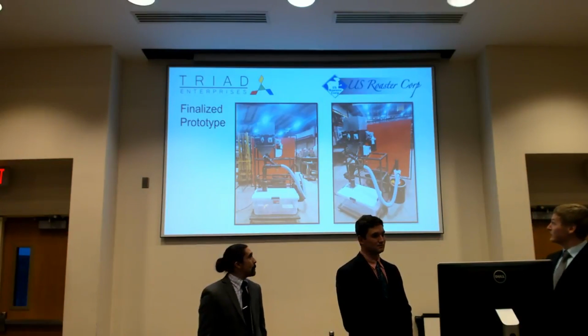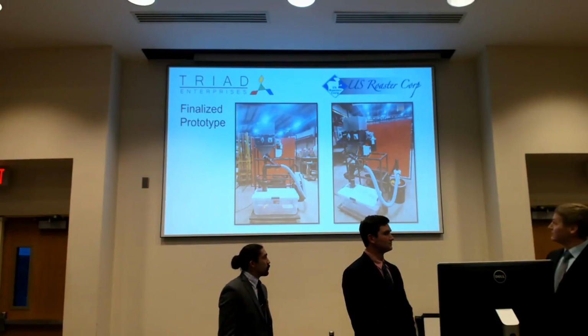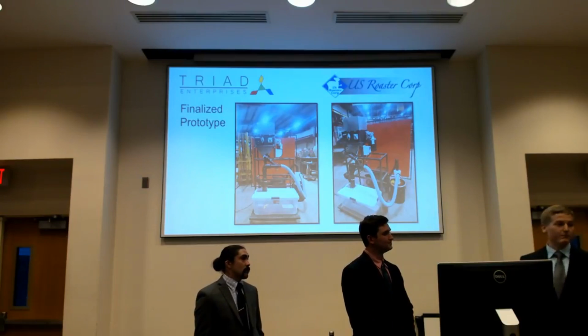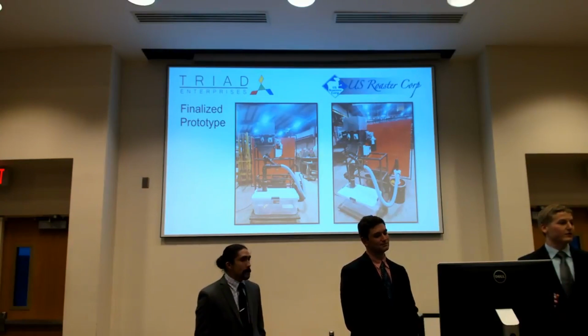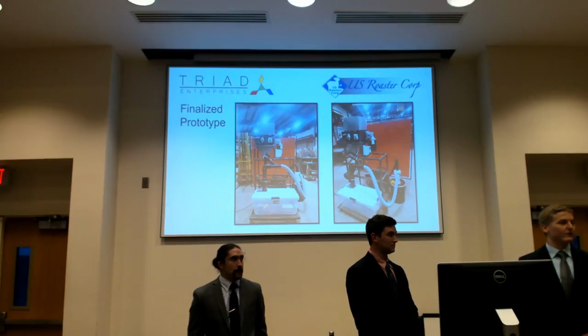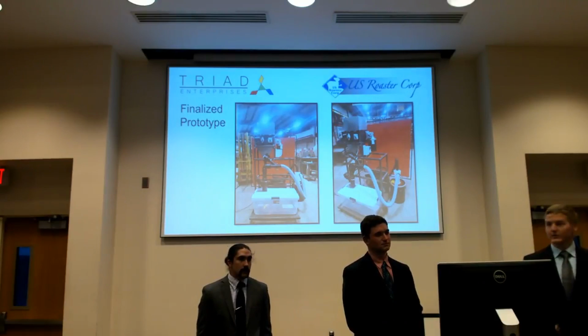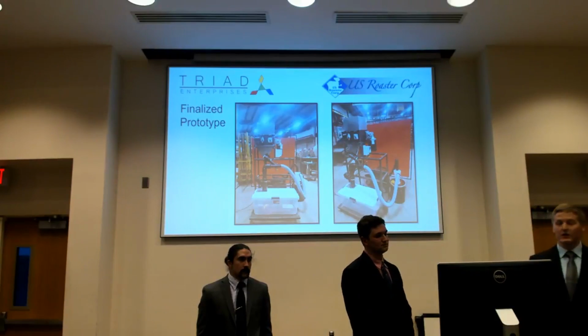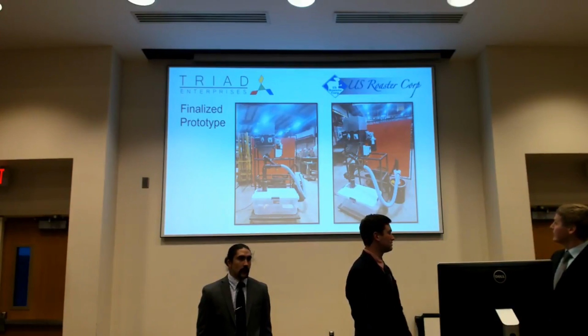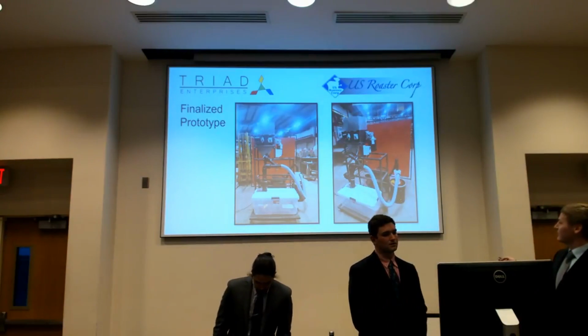For our final design, when we would have a trommel in this area, we would have three stages, so that we could separate based on the size. For the larger sizes, the chaff needs a higher air velocity, and as you go down in size, the chaff requires less. That would increase our efficiencies. The chaff gets sucked in through there, spins around in the cyclone and falls down in there.